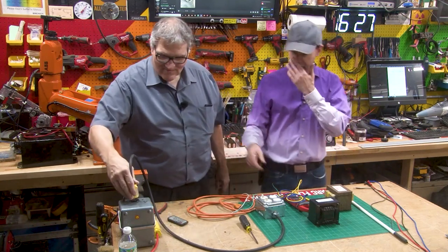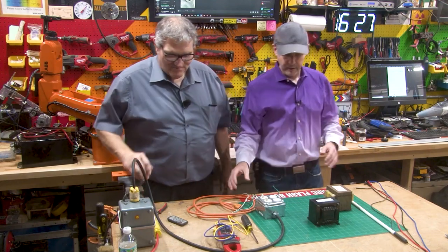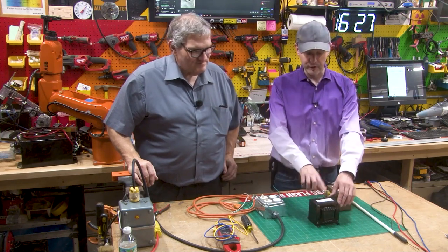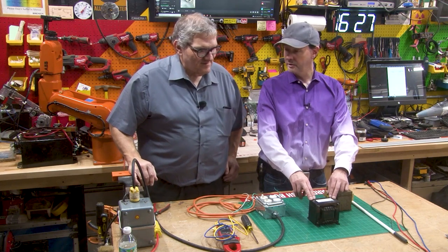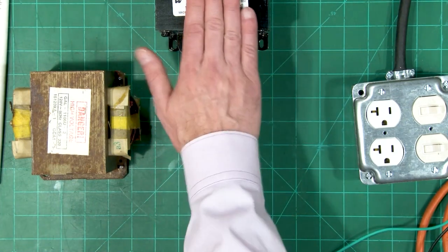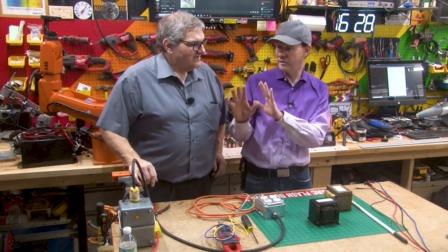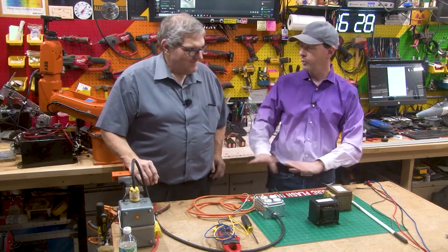You can plug that in, just don't plug the variac in. Safety plugs in your pocket. So we've got our meter. Now this is my plan — we're going to hook it all up with the inductive current limiting in place. Because I have a beautiful Hammond 1905T5. This is a five-amp inductive current limiter — it's a 100 millihenry reactor, and this will limit us to five amps. The variac has a thermal circuit breaker calibrated to five amps, which is awesome. Because no matter what stupidity we do here, I don't have to worry about tripping a breaker and having to run to the other room. We're super safe.